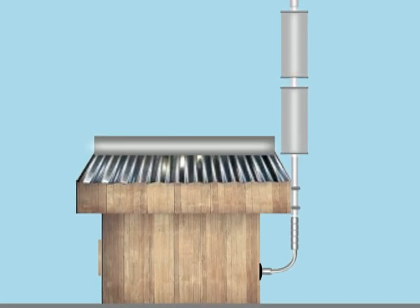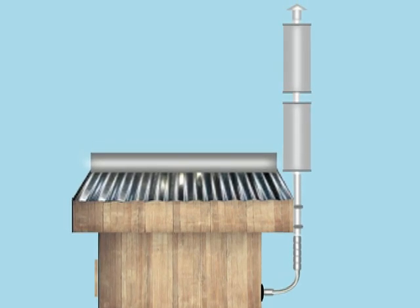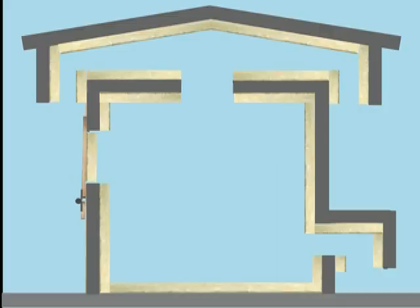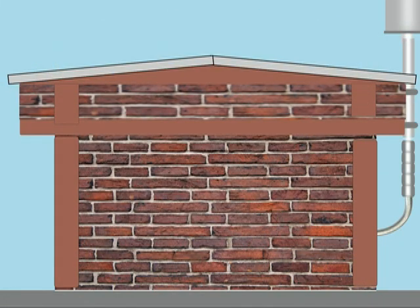The size of the booth should be large enough to house a larger generator, in case power needs increase, or if we decide to buy a generator with an electric start, instead of modifying the previous one. Soundproofing can also be improved, in an extreme case, by building the booth out of concrete and brick, including the labyrinths, which further dampens sound propagation.